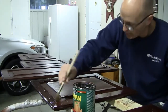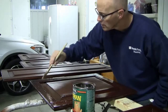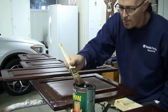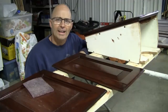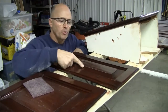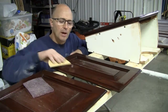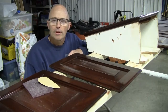Glad you could join us — hope you're getting something out of these videos, and if not, maybe it's good entertainment. We're going to keep putting a few more out. I've got some 320-grit here and we're going to scuff all this. One thing we've got to watch out for is not burning the edges, because then the edges will be light and it'll take out some of the stain. So we're going to scuff this all up, sand it down with the grain, put another coat on, and see how it pans out.